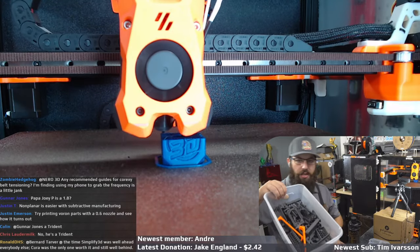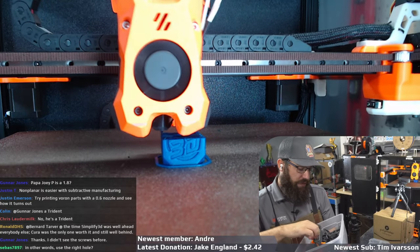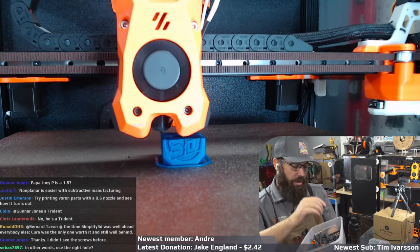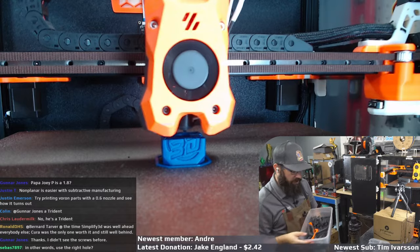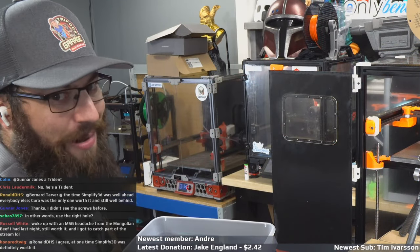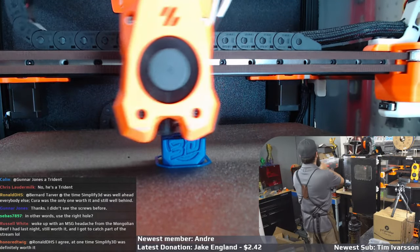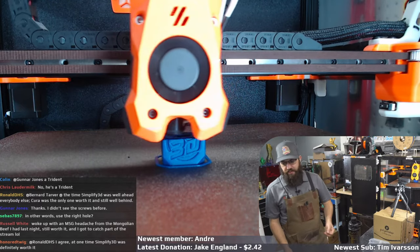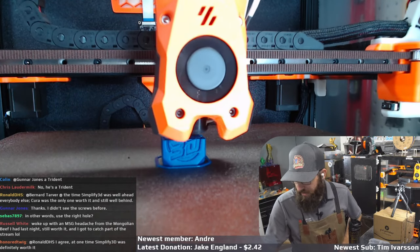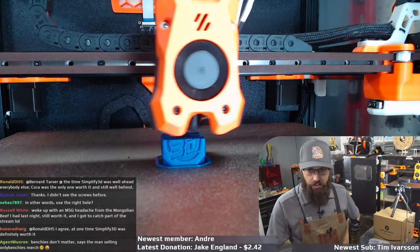Every single part in here for the upcoming salad fork build, or the ongoing salad fork build, is printed with a 0.6 Revo obsidian nozzle in PCCF. So this is all printed with a 0.6 nozzle with the classic engine, not Arachne, because Arachne is broken on Super Slicer. So yeah, it might be fixed though, but. Now you do save a bit of time, obviously.